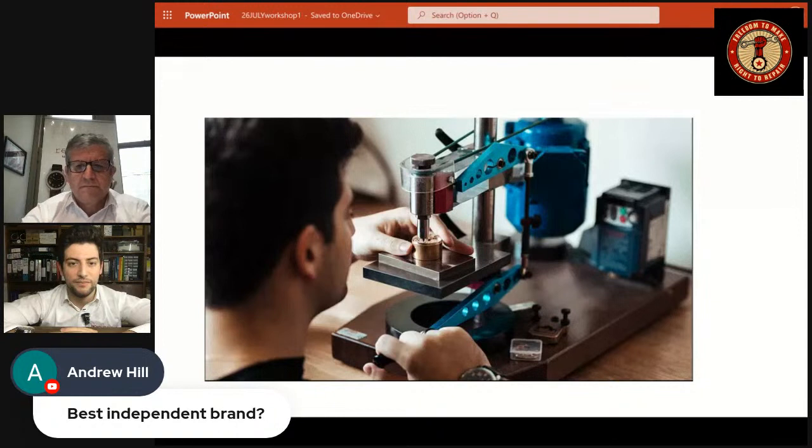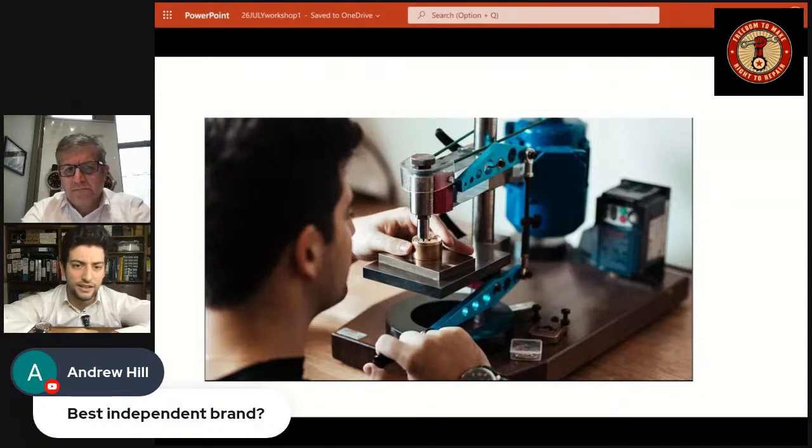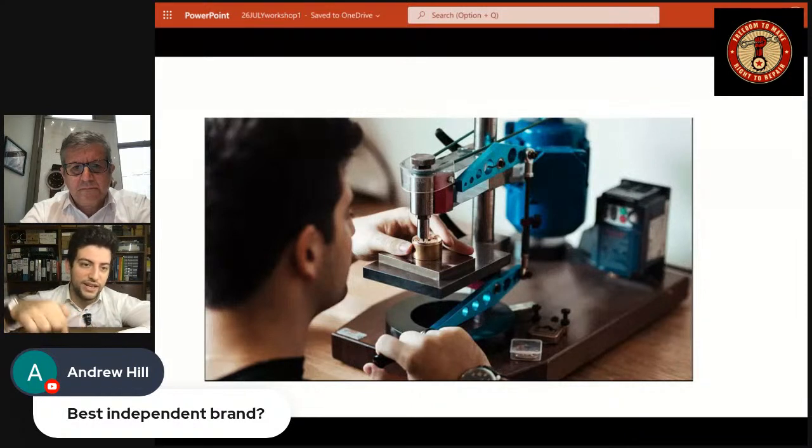And what we can see here is the perlage press. Basically it's kind of like a drill press, but the lever that I'm holding, you move up and down and it pushes the spinning bit up and down. Now, that bit is basically grinding material. You can get different compounds, held together with a very weak waxy glue, and it is a consumable. You might go through one bit in, say, 10 main plates.